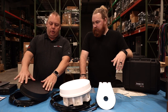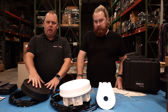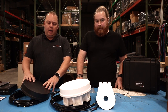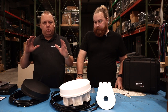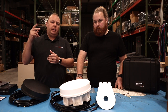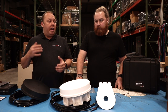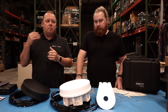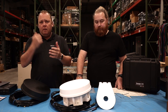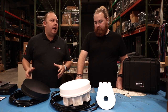In terms of what's under the hood here, these come in two variants we stock. A seven-in-one antenna which is a four-by-four MIMO cellular, a two Wi-Fi element, and a GPS element — that's our most popular. We also stock it in the nine-in-one variant which steps it up to four-by-four on the Wi-Fi. Typically not needed if you're looking at any of our Peplink modems, but we have had certain customers running rallies where they want to add a second pair of Wi-Fi on the roof for public Wi-Fi, food trucks, or first responders needing more Wi-Fi throughput. The housing doesn't change — you just add two more leads.